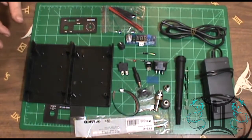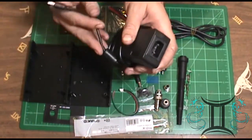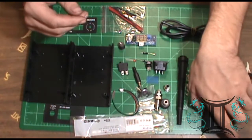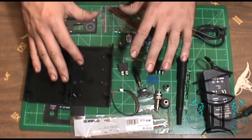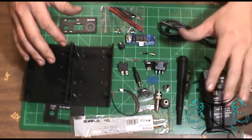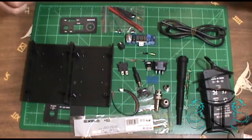I spent a little bit more and got a 24 volt DC power supply. It's a 5mm, 5.5mm jack, because this fan is at optimum output at 24 volts, 3 amps, and that's what this is. It is a 3 amp, 24 volt AC to DC charger adapter. And I'll leave links in the description below for both of these items, both on eBay.